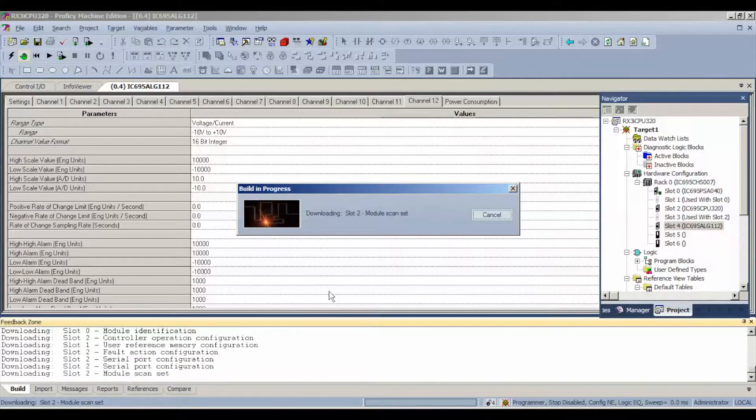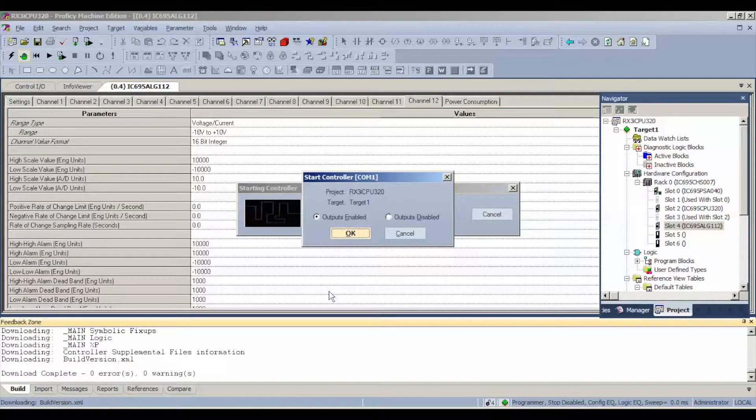While it's doing that, I want to let you guys know — I'm using a three-volt memory battery, about the size of a AA battery but three volts. I have two leads coming off of it, a positive and a negative. I'm going to use those leads to probe these channels. I like to have a voltage that's not quite the full 10-volt limit. If you have a voltage generator that can go from zero to 10 volts or negative to positive 10 volts, that works great too.